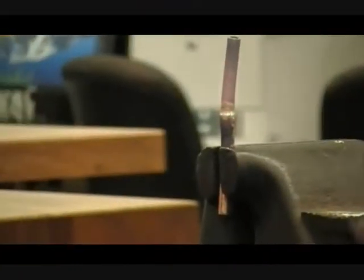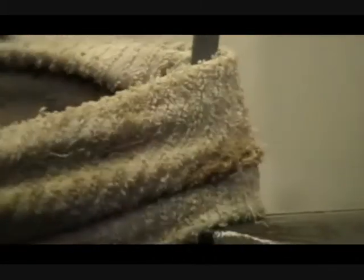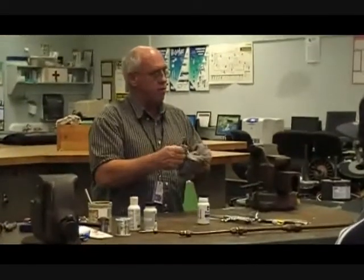If I were doing this in front of a plumber, he would say, 'Man, you have overheated that pipe.' I have not. We have to bring it up to the point of having good flow. Y'all hear that sound change? I haven't changed the pressure on here. What just happened was when I first touched it with the rag, that water in the rag turned to steam. It was actually pushing the rag off of the pipe until it cooled down enough to come back. I guarantee you, if you did grab hold of that, nobody's mind is quick enough to even know they got burnt until it's happened.